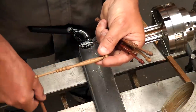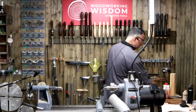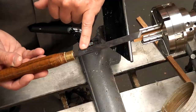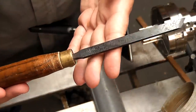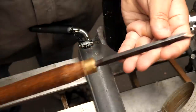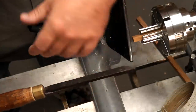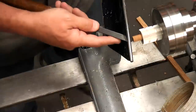I'm going to make two bobbins — a quick Honiton and then a quick Midland. My first week as an apprentice was making these with this skew chisel here. This is a very old Robert Sorby skew chisel — you can still see the Robert Sorby branding and the little kangaroo associated with the brand. It has the original ash handle; it's hand forged — basically beaten with a hammer. This is the one I used as an apprentice and it still has lots of life in it because I do a lot of hand honing rather than mechanical sharpening.